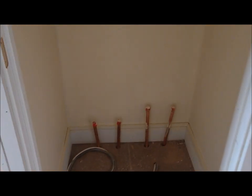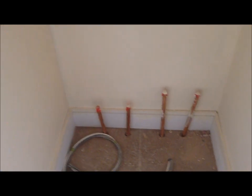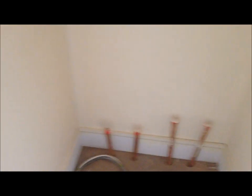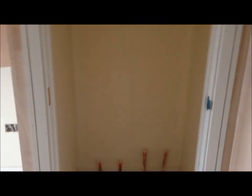It'll take you twice or three times as long without getting paint over everything, so generally they want you to completely finish it. This has all been double coated, apart from that top section I can't reach — that'll only take the following painter a couple of seconds to cut in. So for the airing cupboard on a base coat in a new property: completely finish and double coat it. All you've got left is the skirting boards.